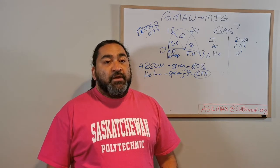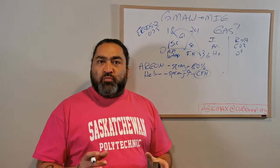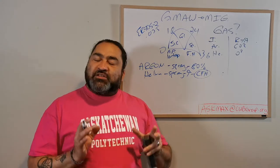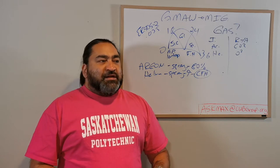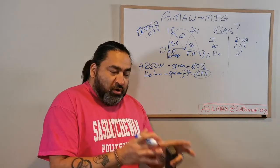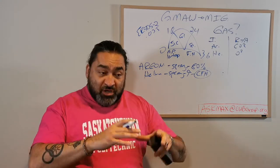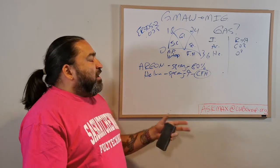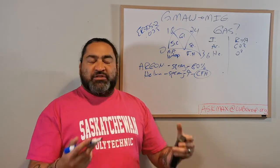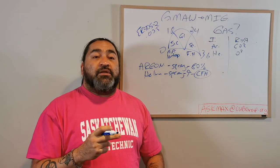and it's going to be a lot of money. Now, there are situations where I want a lot of helium because helium being smaller does affect the weld slightly differently. It does allow for a deeper penetration on thicker joints because it keeps things more in line because you have a more dense cone of penetration of the gaseous shield. So, if I'm going to be welding, for example, and this comes up often in the third level question, so good thing to put in the bank, right?